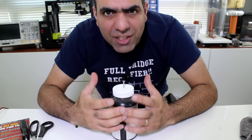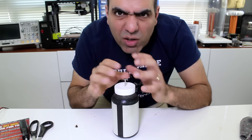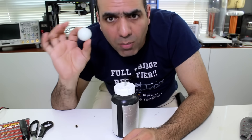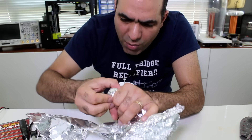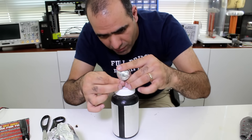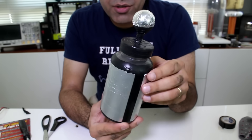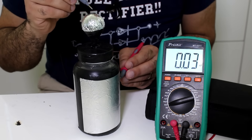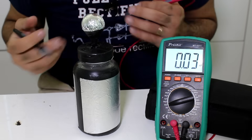I add some length of metal wire to the end of the screw, which will help increase the surface contact to the salt water and reduce resistance. The actual Leyden jars have a smooth metal sphere at the end of the rod to remove sharp edges where charges can run away. I don't have a metal sphere, but I have a ping-pong ball I can wrap in aluminum foil to make it as smooth as possible. According to the meter, the Leyden jar is around 1.5 nanofarads — pretty small, but around what it should be.